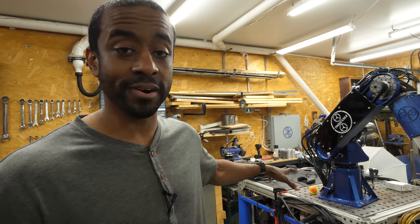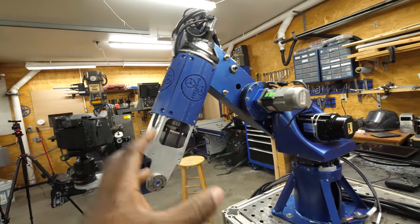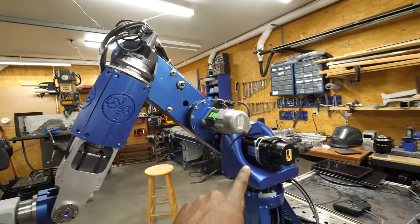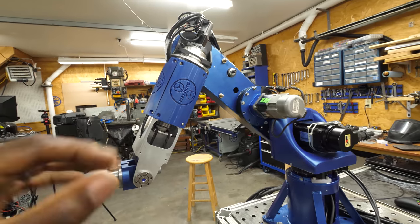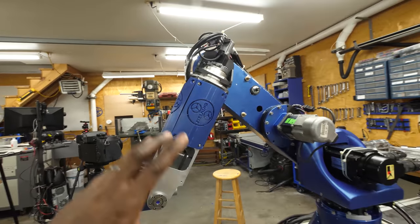The faster you want it to move — especially the starts and stops — is going to require huge reactionary forces from whatever it's mounted on, and a significant amount of power from whatever motor is trying to accelerate your load from a stop. I haven't fully tested it yet because I don't have limit switches hooked up yet. With one kilowatt and 750 watts, this thing is super dangerous and I don't want to risk injuring myself before this assembly is complete. So I'm going to machine those pieces first and then fully load test it.